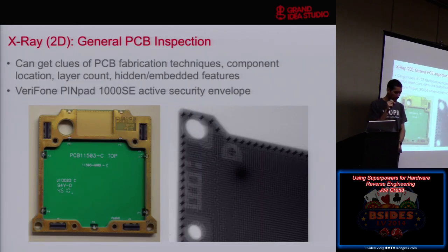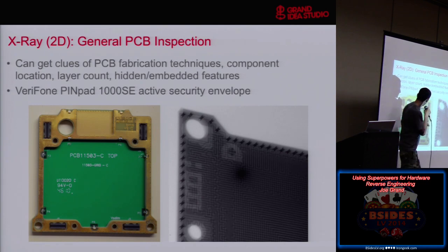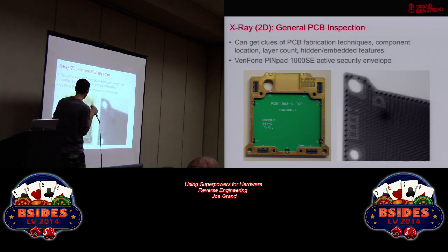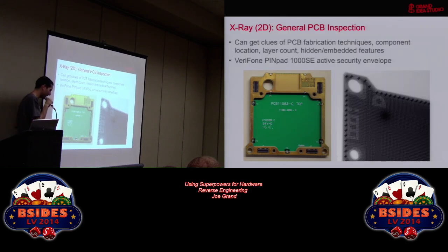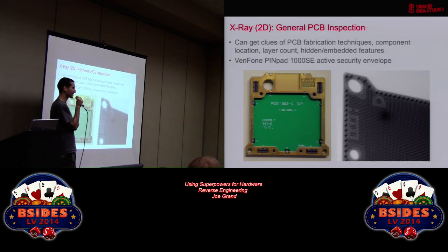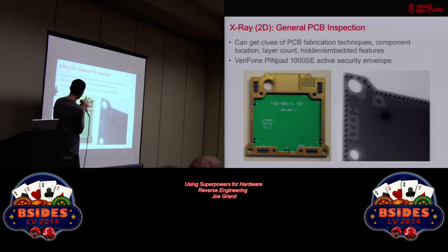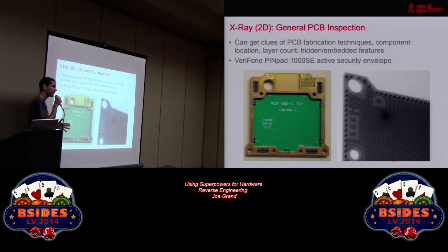I found a patent application by Verifone for what they call an anti-tamper protected enclosure — a separate PCB containing one or more unique trace layouts used to create a secret pathway of a specific impedance. Inside the patent application were all the details of how the system worked. I brought it over to the PC board facility when I was doing the X-ray experiments. We put it in and it turns out it's a four-layer board — four layers of basically a maze, all coming out to four sets of connectors on the sides and underneath with four pads on each. So I now have exact Gerber plots, the exact PC board layout of how the system works — use that as the first step, figure out how it works, figure out how to defeat it, take advantage of it.